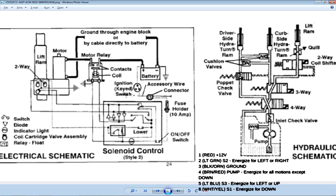Now let's push the up button. 12 volts comes in, hits S3 pretty much directly. It hits a blocking diode on the other path, but it energizes the pump. So we've got S3 — the four-way valve — and the pump running. The pump pushes pressure through the energized four-way, so it goes straight through. The three-way is not energized, so fluid comes over here and pushes on the lift actuator, causing the plow to lift up in the air — exactly what we want. At this point it's being held up by this check valve here.